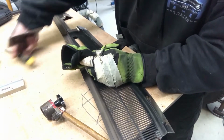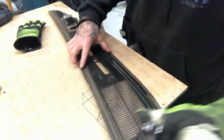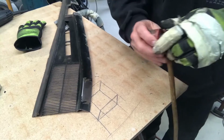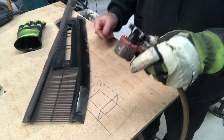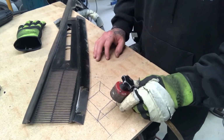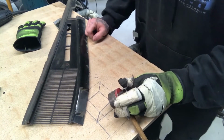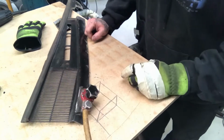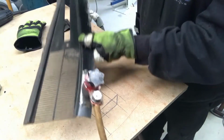which when I first started welding back when dinosaurs were around, I didn't take into account just how important earth was for welding. I mean, I'd earth it, but just make sure you do have really clean metal. I use a magnetic earth, it's from Milwaukee. A clamp-on earth is fine. I just find this is handy because a lot of the times if you're welding on a big panel, you don't really have anywhere to clamp onto. So that's my earth on freshly clean steel.